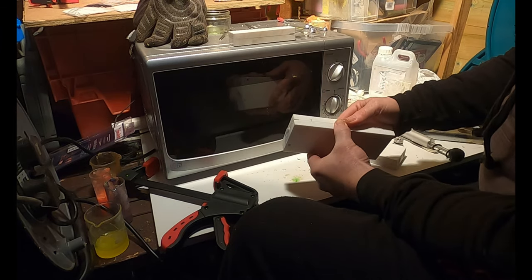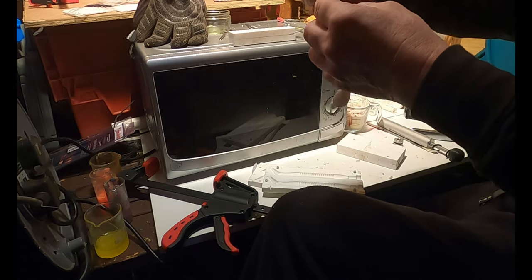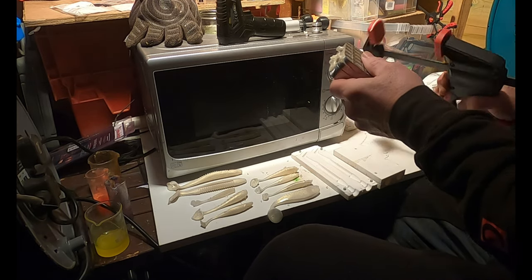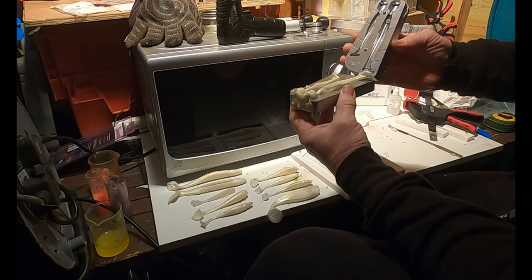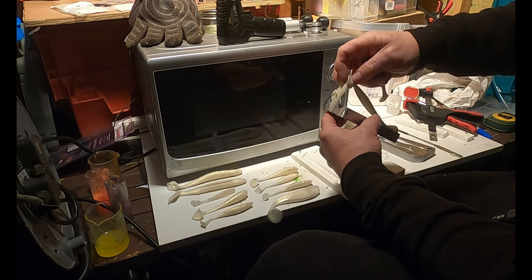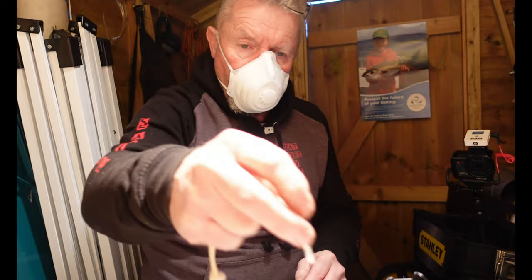Let's see how the big ones are going - I don't think these worked, but we'll see. Oh no - wait, I got one out of it that worked, all right. I thought I'd have one more go with the metal mould. What I did with the mould was I sat it on top of the heater for a little while - not to make it hot, just to take the chill off it. Look at that! That made a lot of difference didn't it - just not having an icy cold mould. The stuff chills as soon as it goes into the mould. We had a result. Let's get rid of the sprue and put that into the remelt pot.